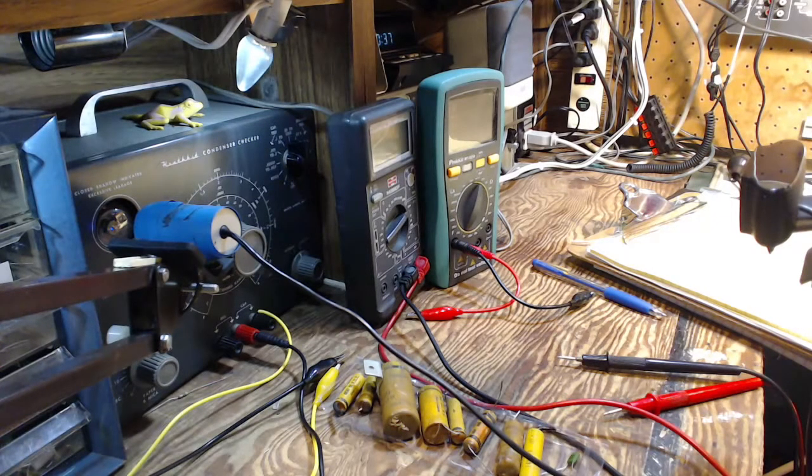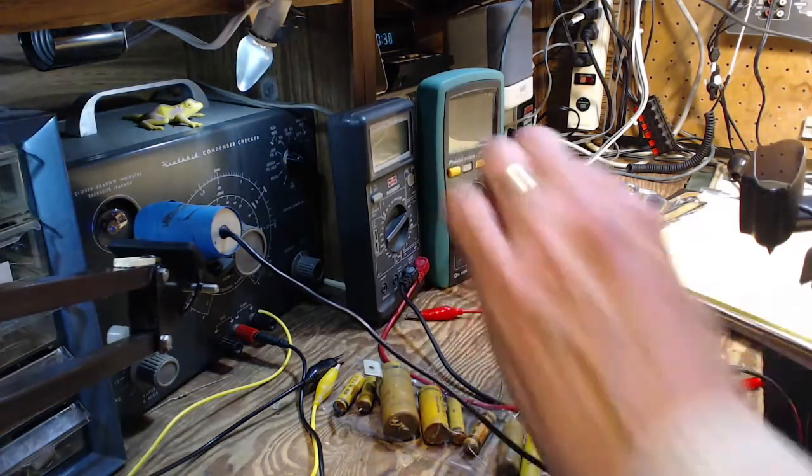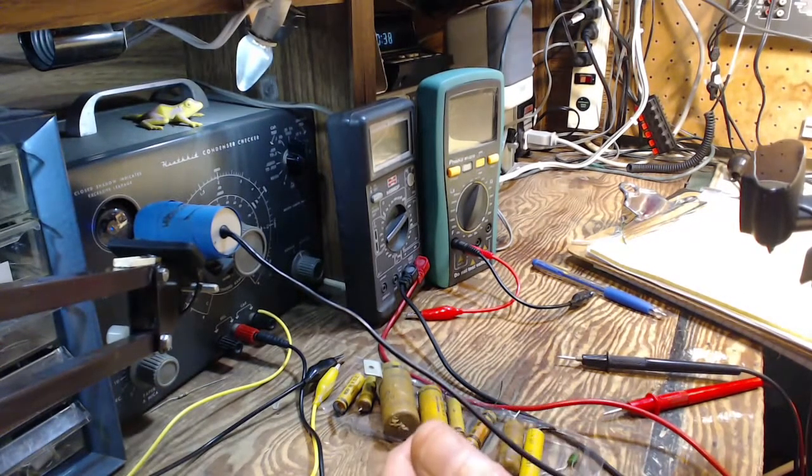What happens is, under electrical stress, when you charge up the capacitor, some of the molecules rotate or are displaced slightly. They don't really go any distance, but like a spring being stretched, they're pushed into a new position due to the electrical charges on the plates around them. Then when you discharge the metal plates, in this case probably just aluminum foil, by shorting out the leads of the capacitor, these stressed molecules or atoms begin to relax back, because they're no longer being pushed by the electric field. And as they relax back, a charge imbalance occurs in the dielectric, and it appears on the plates and can be measured on a voltmeter.